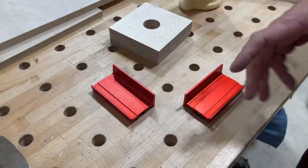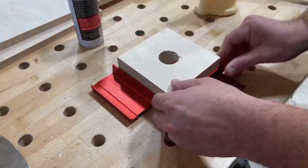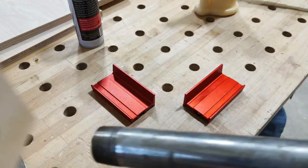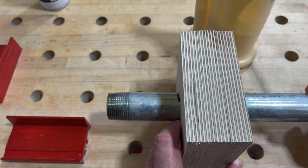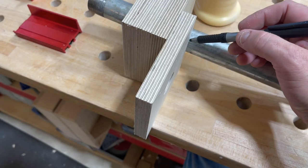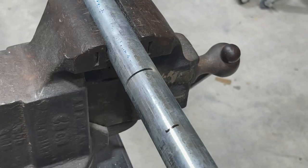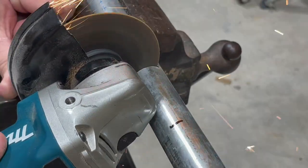Now proceeding with a little more caution, I glue all three correct pieces together. You can see it's going to fit into a galvanized steel pipe — we've got a loose fit, but that's kind of by design. First I have to cut this pipe to length: I mark how far it goes into the speaker and into the wood, then bring it to the vise. I love having a mobile vise so when I'm cutting metal and making sparks, I can get it away from the walls and anything flammable.